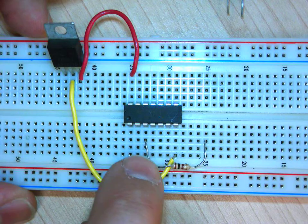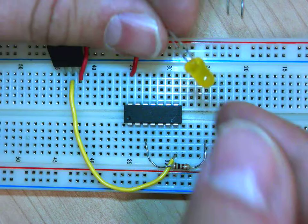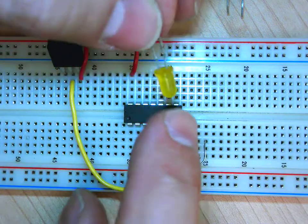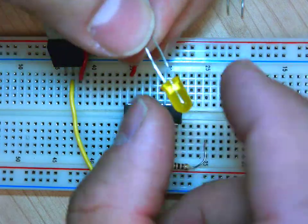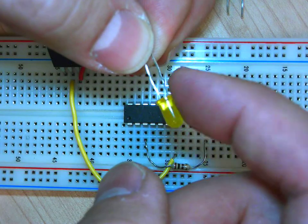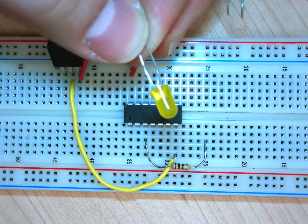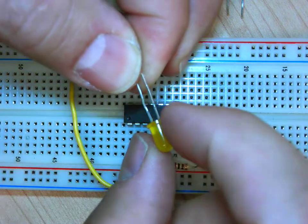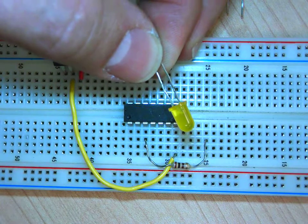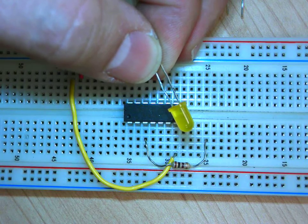Okay, so this is pin 3, and this is the out. I'm going nowhere here, and now I need to take my diode. If you look at your LED, it's a diode, but it's a light emitting diode. If you feel the edges, there's one of the sides that will be notched, right? So it's this side in my case, right? Just put your finger and you'll feel one of the two sides is slashed, right? So that tells you this side is where the arrow points, if that makes sense, right? It's the direction of the arrow. It's like the front of the diode.